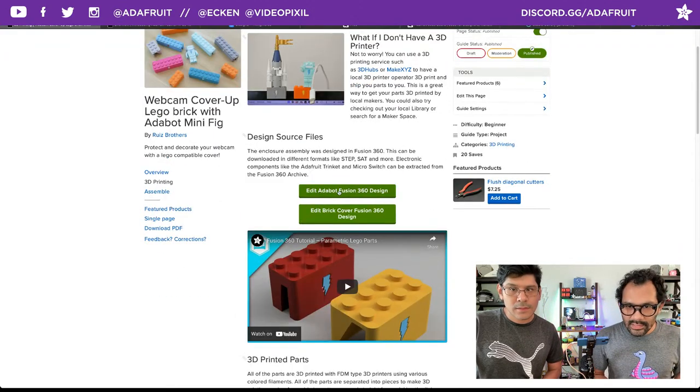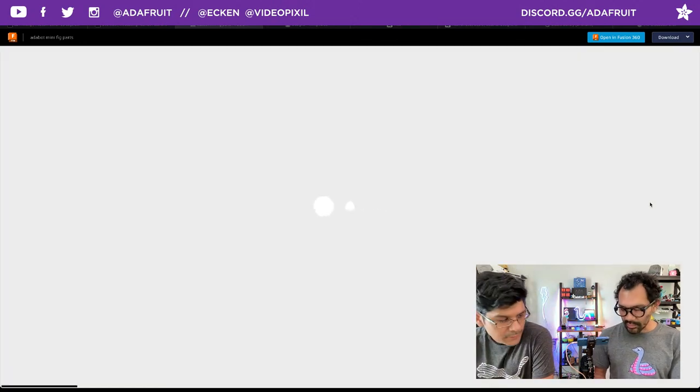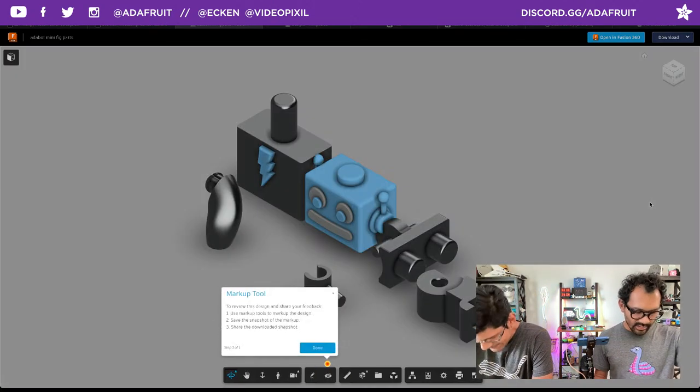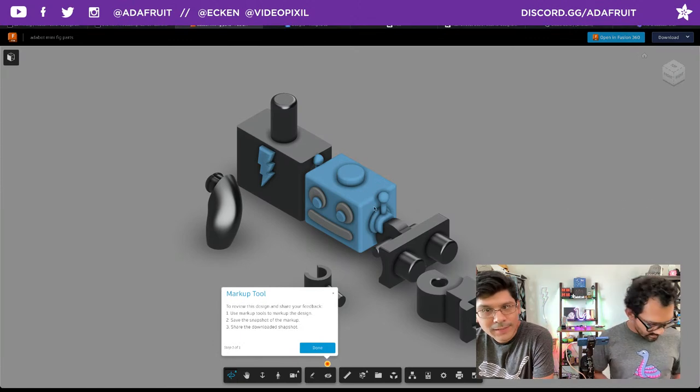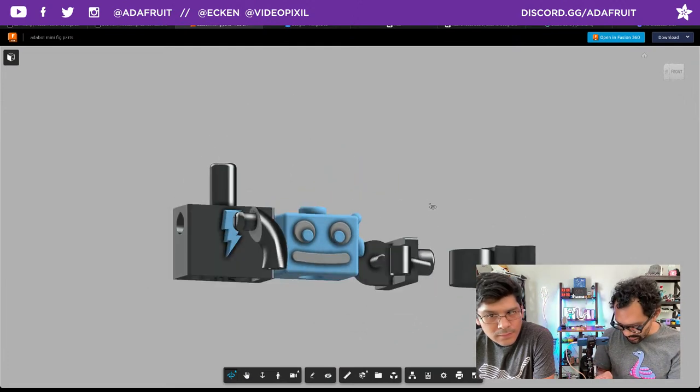I think the only important setting for this one is to make sure that it is printing at 100 microns, so it is nice and detailed. Yeah, that's a big smooth note. Tolerance. Say it again. 100 microns, 0.1 layer height, not 0.2, 0.1. I mean, it'll work, but if you look at the face, for example, this one was printed at a 0.2.